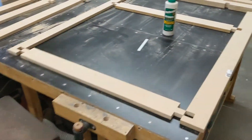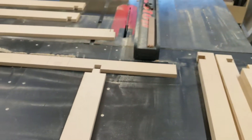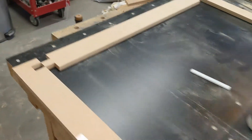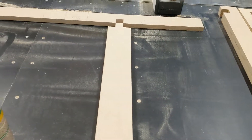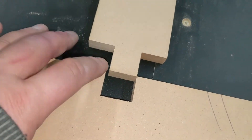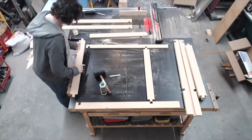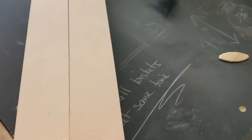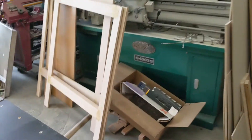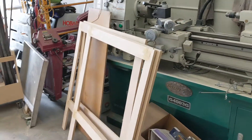Time to glue. I've got lots of parts that are kind of the same but not quite, so what I'm going to do is glue up the ones I know I can, to get them out of the way so I can finish measuring the last few bits. I've cut the notches on the front ones and I'm just about to make a cross member for the front. The mortise was a bit too big on one so once I've got it together I'll put something in there to hold it. There's essentially a 40-inch gap underneath which lets me roll in the Crossfire — once the casters are on it goes up another four inches, so I'm going to chop four inches off the bottom of all these, then mark them out for biscuits, cut the biscuits, and glue it together.